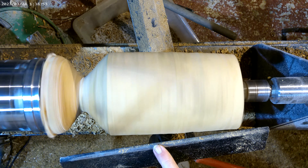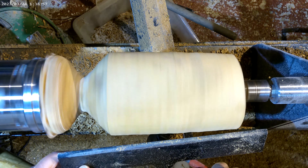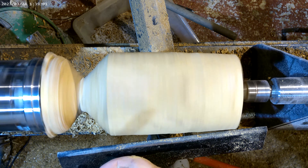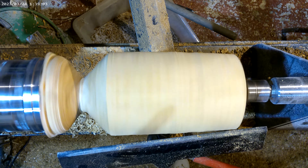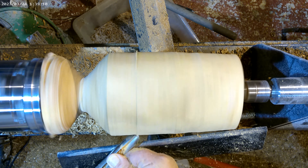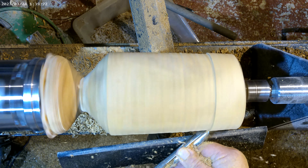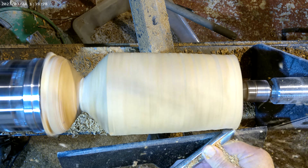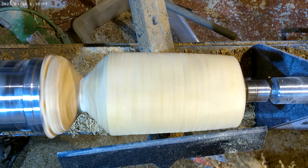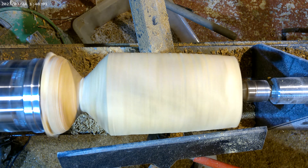What I've done is put my rest over at the angle I want to achieve. So that when I cut, my finger holding the chisel can just follow straight along there and I'll replicate that cut. That's the look I'm going for — it's quite a sort of elegant champagne flute.